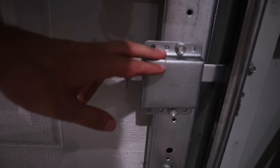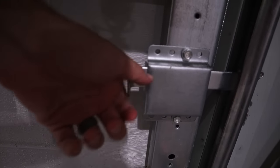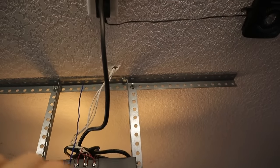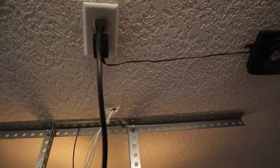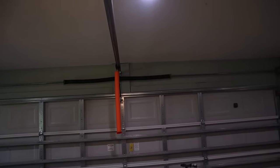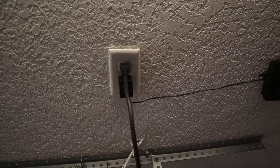This isn't really feasible for everyday use because eventually you'll probably forget it's locked, try to open the garage with your remote, and if you do that while it's locked you could do damage to the opener itself and have to replace it. Another safety precaution you can take if you're going to be gone for a while is just unplugging the garage door opener. That way, if somebody somehow gained access to one of your remotes, or if you know of somebody who has a remote, there's no way they can use it to open the garage door. However, this would not stop somebody from being able to get in by fishing the cord through the door like I showed at the beginning.